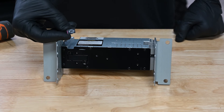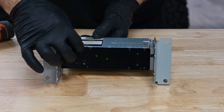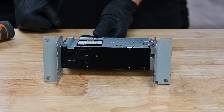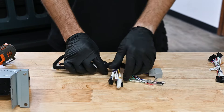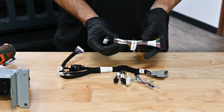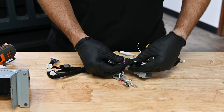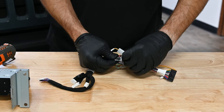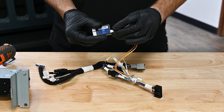If you're installing the optional iGo navigation software, insert the microSD card into the slot. This will give you maps on your Horizon 10 without using your cell phone. Locate the main vehicle harness — there are three connectors that will connect to the Horizon adapter harness. Connect the 2-pin connectors, the 14-pin main connectors, and the smaller 8-pin audio connectors. This small 3-pin harness connects into the small port on the PAC link.